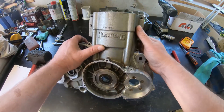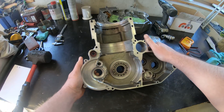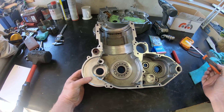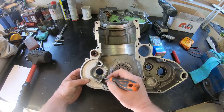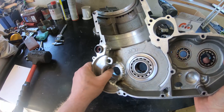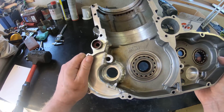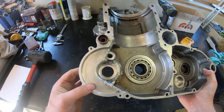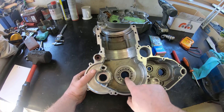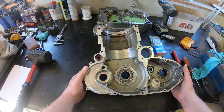The housings for the counterbalancer are in place, welded on the crankcase. As we left about one millimeter on the radial, we had to do one additional machining to get the tolerance we need for the bearings, and to make sure that these are properly aligned — with the centerline between the main bearing and the balancer bearing — to make a proper fit with the toothed gear.